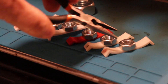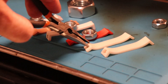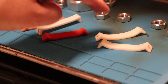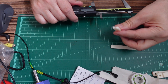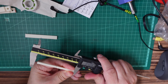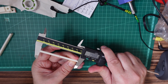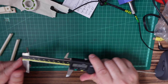Taking a closer look: for the first feeling the HT is a little bit softer. After one minute I can touch them, and now they both feel very equal. For ABS, the shrinking value is very important — not only because of less warping, but also for dimensional accuracy in mechanical parts. Measuring HT: 79.62 mm. Glass fiber: 79.88 mm. Significantly less shrinking on the glass fiber version.